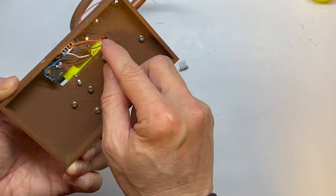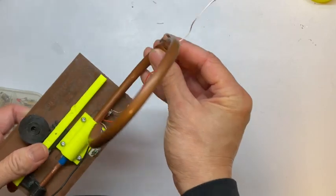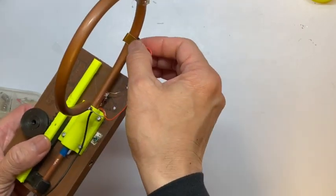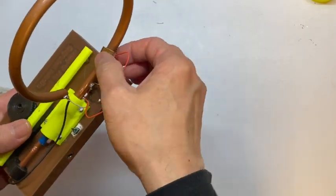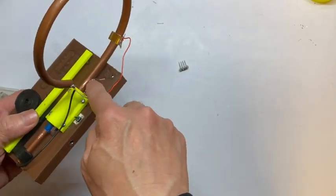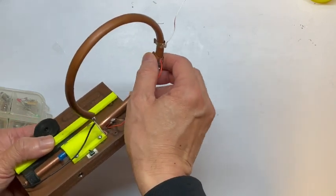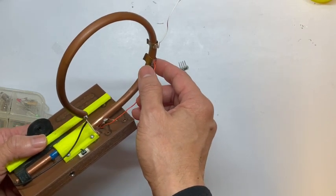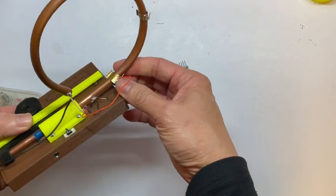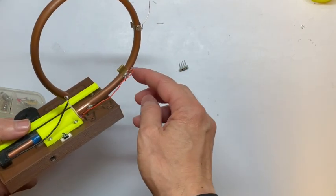And also to the orange wire, which is the detector's input. We can tap to any part of this coil using this copper spring that I made using thin copper plate. You can just clip it here and slide it to find the best tap spot, which gives you the best sensitivity versus selectivity by shifting it up or down the coil. The closer it gets to the grounding point or the cold end, the better the selectivity but the poorer the sensitivity. If you start moving it up, you can get louder output but very noisy with poor selectivity — it will be like mixing all channels together. Usually I put it close to the grounding point, about one eighth of the circle.